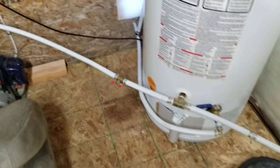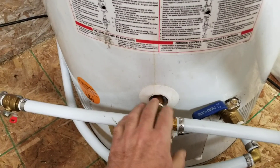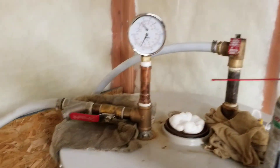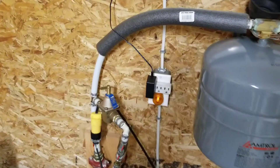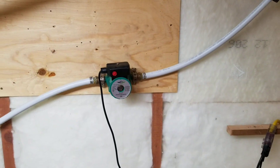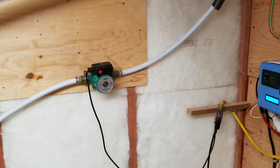The return line comes back in to the system. The warm water returning will go straight back into the boiler, or the excess will go into the hot water tank, or vice versa. There's an overpressure valve that will blow off if needed, going to a dump outside, and a drain valve for if I need to drain the system. This crucial pump runs 24-7, and I can't let it stop as long as the boiler is hot — that's why it's tied into my solar and backup system so that if power goes out, this pump stays running uninterrupted and never overheats the water.